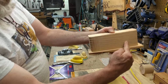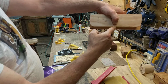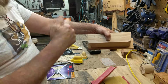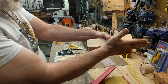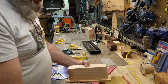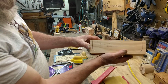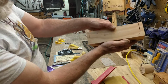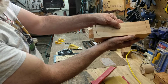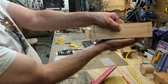You want to follow the contour, okay? That's why I was saying when I was cutting these out on the bandsaw, don't go crazy on your waves. Try to be as straight as you can. Take a little liberty, do what you want. You'll figure it out over time that when you sand all your parts and you put it back together, you want to have those nice crisp lines like you have here. And look at it. You can hardly even tell that is a drawer.